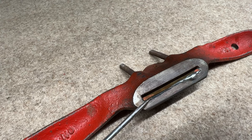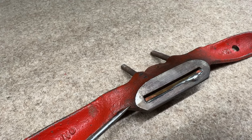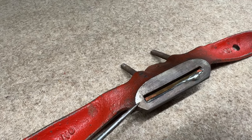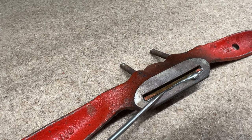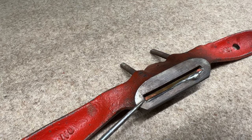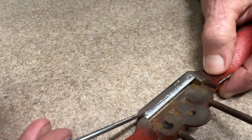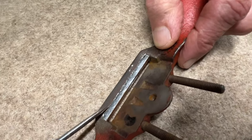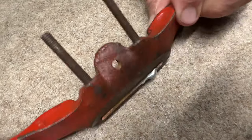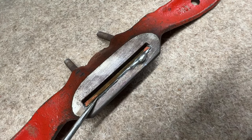for some reason it wasn't flowing on this side. And first I thought maybe we were too close to the vise and there was a heat sink issue on this side, but that turned out to not be the case. I tried it a couple of different ways. So now we have a result which I think is okay. I'm seeing flow up here, flow along the length of this, but I can't be exactly sure that we have the penetration of solder that we wanted down here.